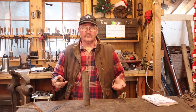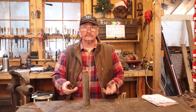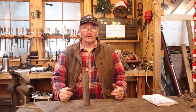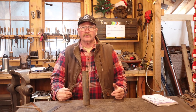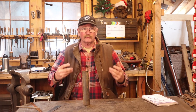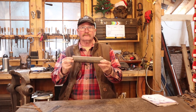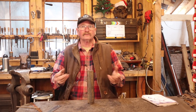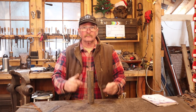The first question is, is it hardenable at all? For all I know, it is mild steel. It could be 1018 mild steel, really low carbon — great stuff for forging projects, but not very good for forging tools. Or it could turn out to be something like H13 that's air hardening and is a high temperature work steel, and is phenomenally expensive. This is about a $200 hunk of H13, so I hope that is not what he sent. My guess is it'll be something else — I don't know what the original source of this material was, just something he came by.